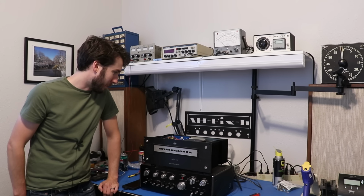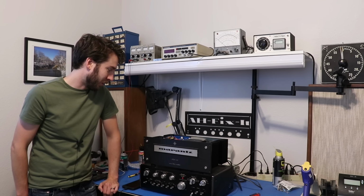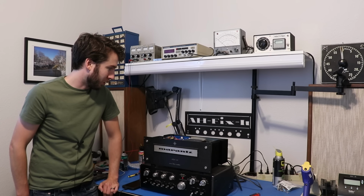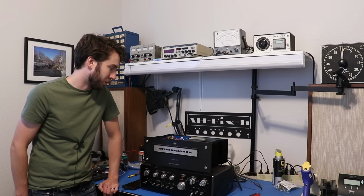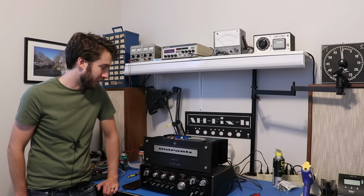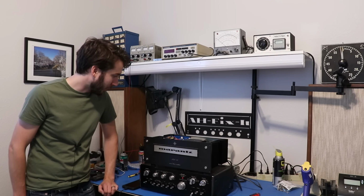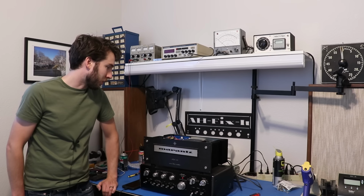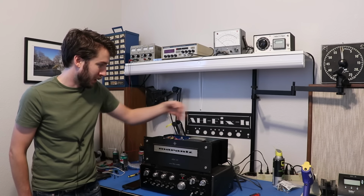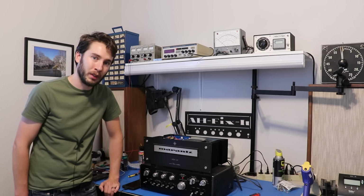It's just kind of a mixed bag because of how notoriously unreliable it is. But as far as I'm concerned, if you go through and you do what I just did, you replace all these resistors and you make sure your transistors are properly matched and good substitutes if you need to go that route. I was very fortunate to not have to do any of that. I didn't have to change a single transistor in here. So, also, these NTEs and these Motorolas appear to be behaving in the exact same way, so that's a good reason to just leave it alone.